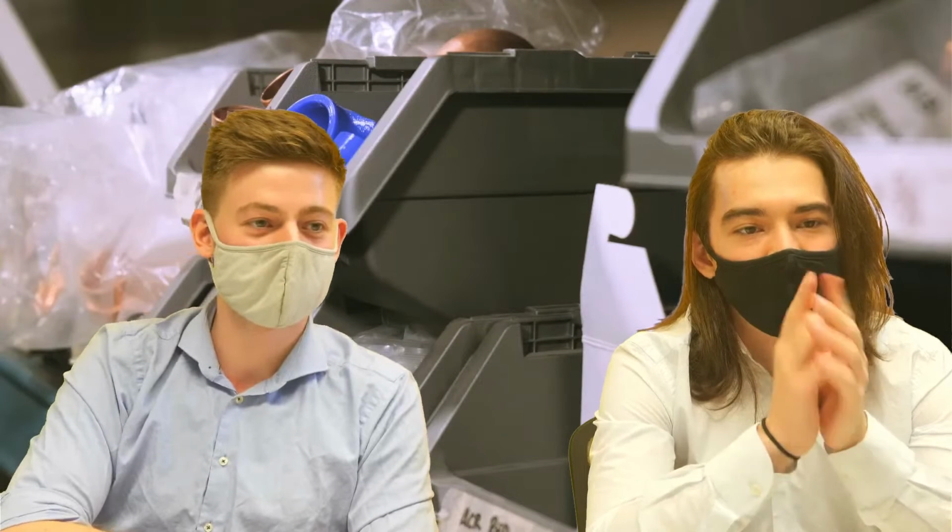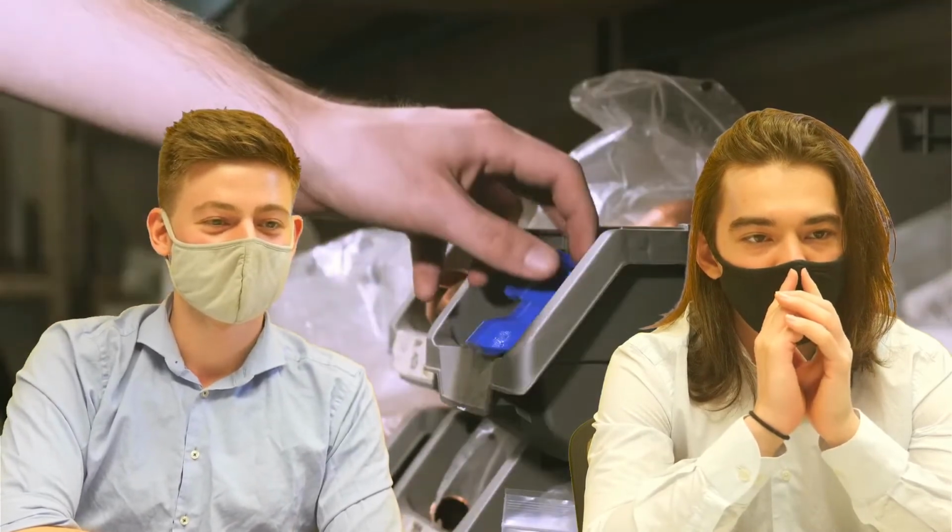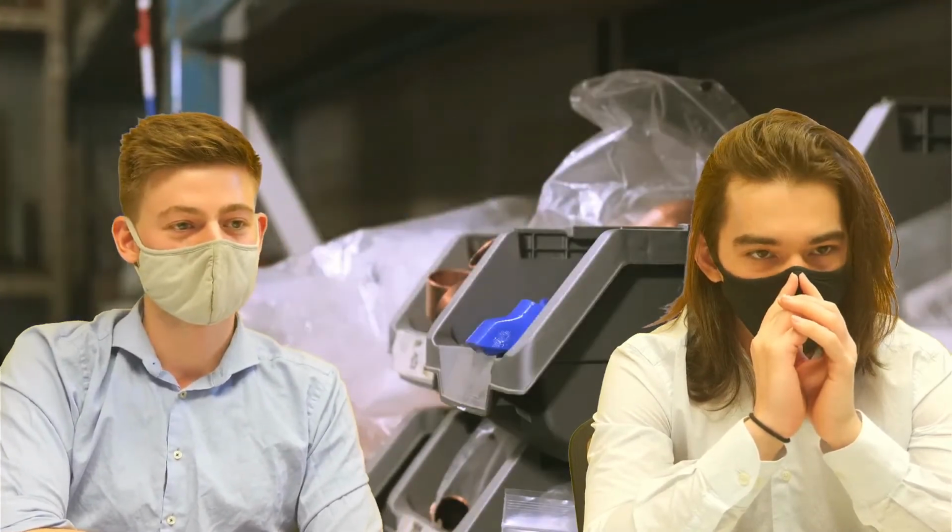Oh, tada. Al has found the perfect settings. That's what I recommend. That's pretty much exactly what we use on Vapor, although sometimes I go hotter for the first layer. I go to like 245 for PLA. Yeah, we print real hot over here.